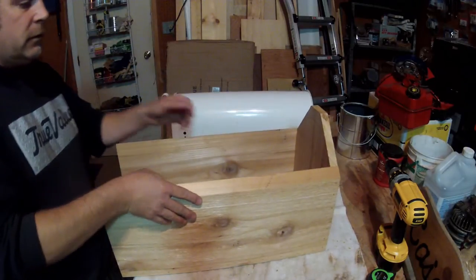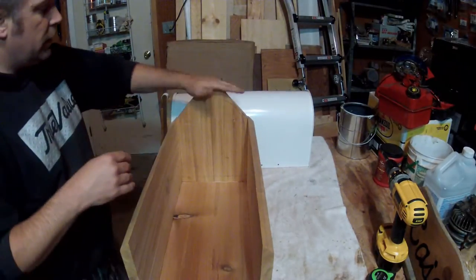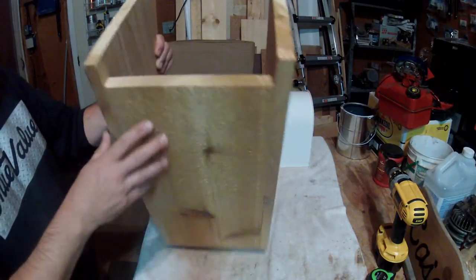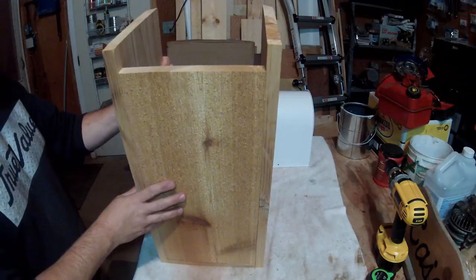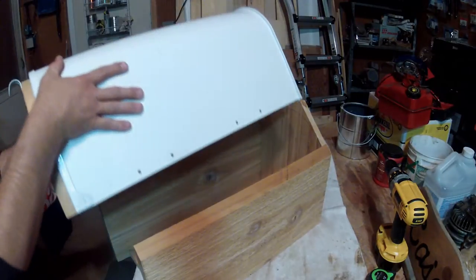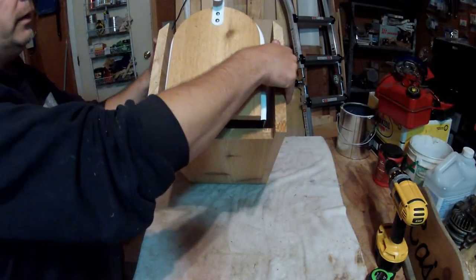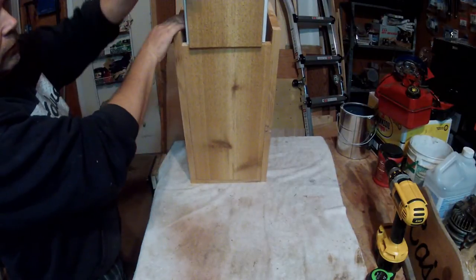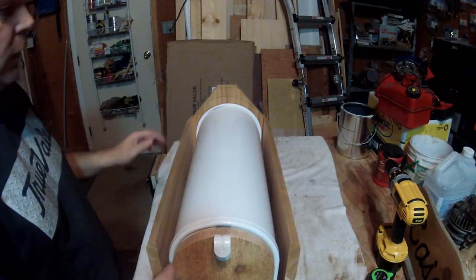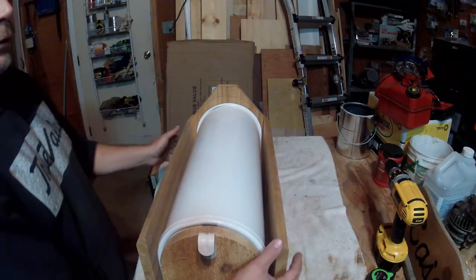Here's what I've got so far — just a simple box, sloped on the sides. I had to make the bottom part a little bit shorter than the rest, and you'll find out why shortly. The idea is to set the mailbox inside here. There needed to be some space on the bottom for the door to swing open. Being outside and being cedar, this thing is going to get wet, so I might drill some holes down here to allow water to drain out.